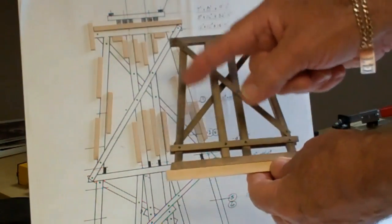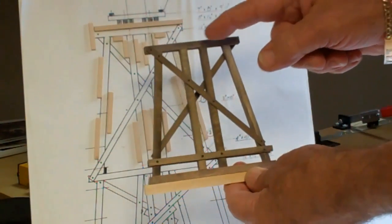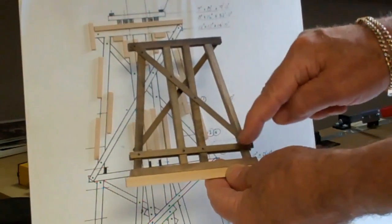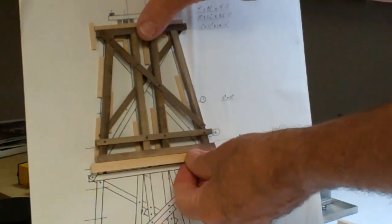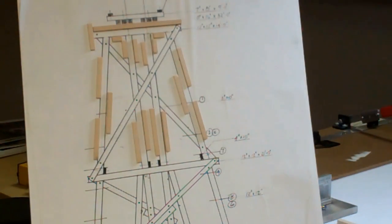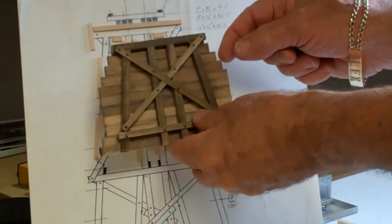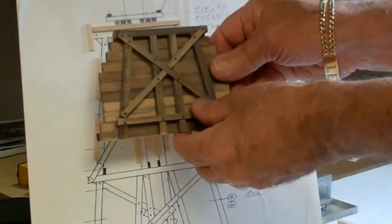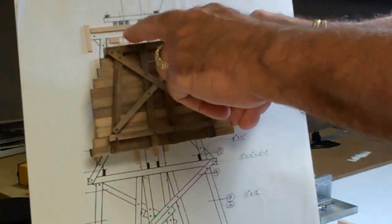All pre-cut pieces have been assembled using this jig. The top cord, 12x12 posts, diagonal bracing are in place, and I've installed the NBWs along here that hold the whole assembly together. Each bent comes right out identically the same. There's also what I call a retaining bent — the same design but with 8x16 timbers placed across the back at the beginning and end of the trestles to hold dirt, gravel, and rocks back. The bridge will go across the top.